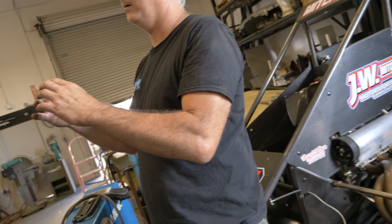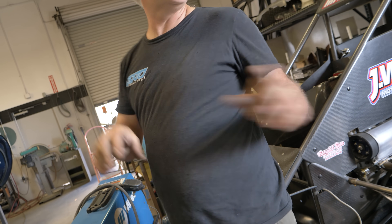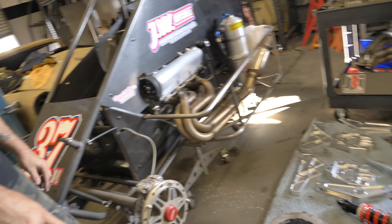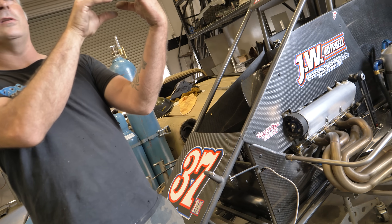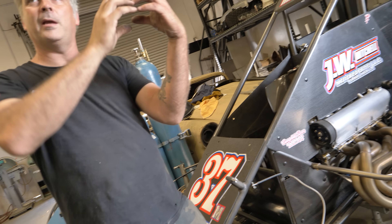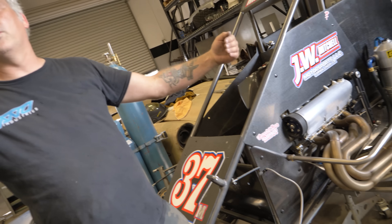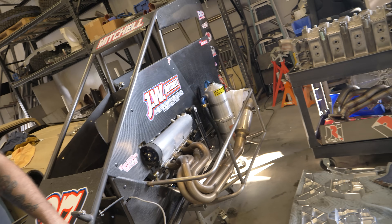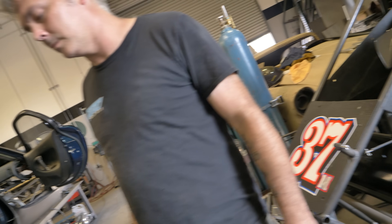The way that it is, it's a gear but it's round, so it allows for some movement because these things still have suspension travel, even though the motor is hooked directly to that. The gear is a straight spline, so it slips in but it's rounded, so it can still move up and down. With the suspension and solid motor rear end, you're hooking them both together, so it needs to have a little bit of movement for this application. It would just stay kind of straight. I think it would work because these things are 900 horsepower in the big ones.